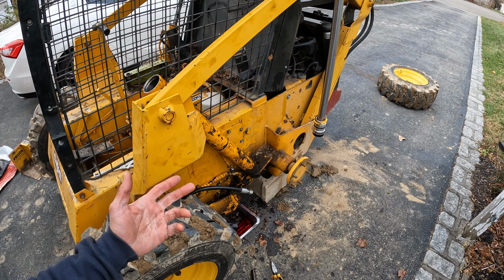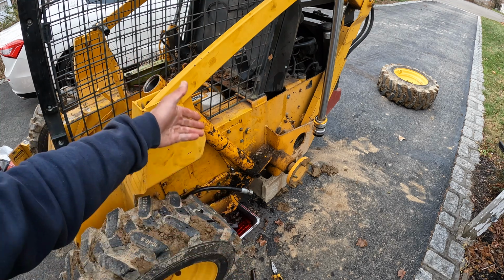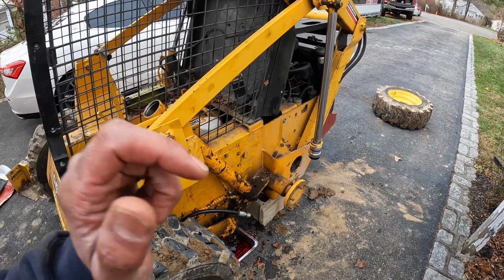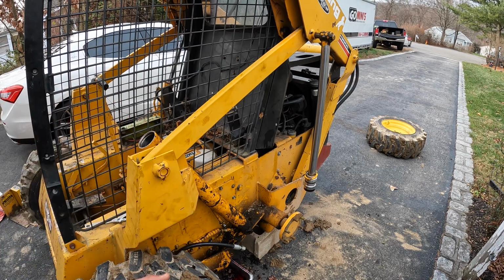You really do need 2 people to do that because one person has to move the barrel around and the other person pulls. So you're relieving the pressure off of the pin. All the hoses have to be disconnected in order to get the piston out, again, to relieve the pressure. Once we loosened everything up and disconnected everything, obviously it came out without a problem.